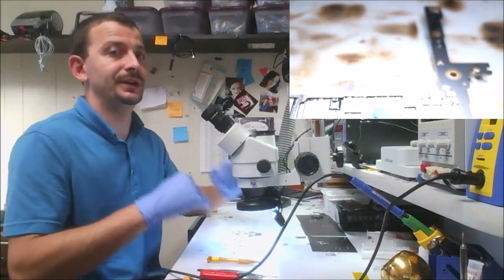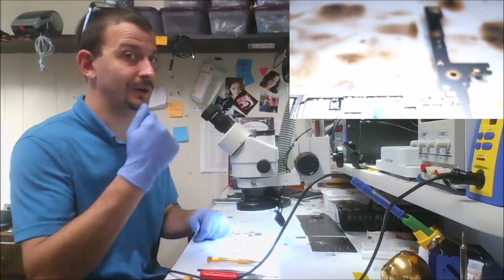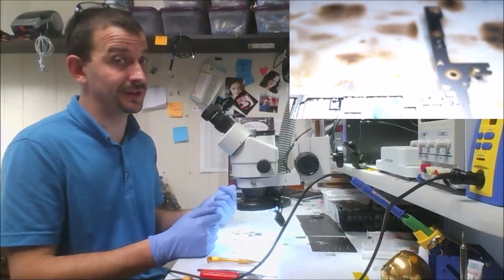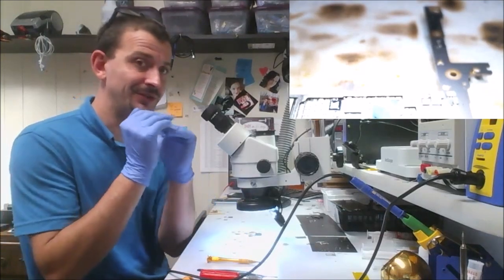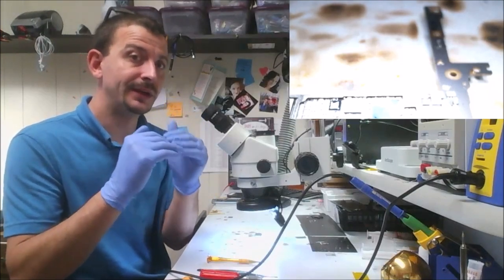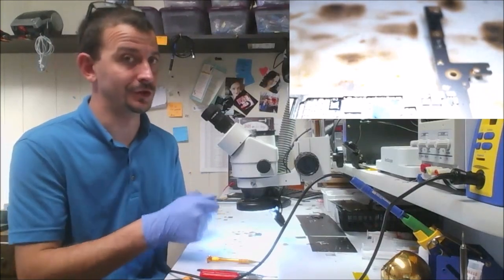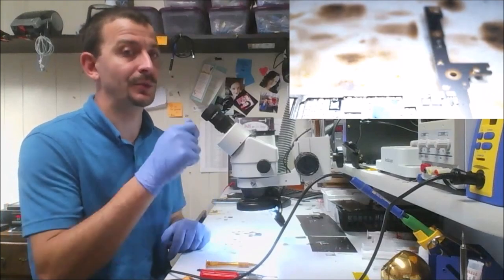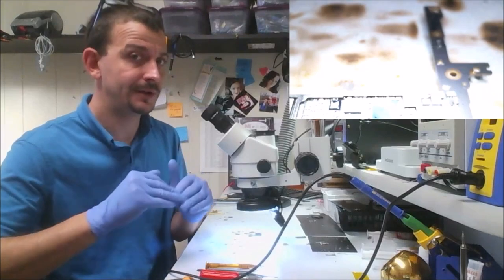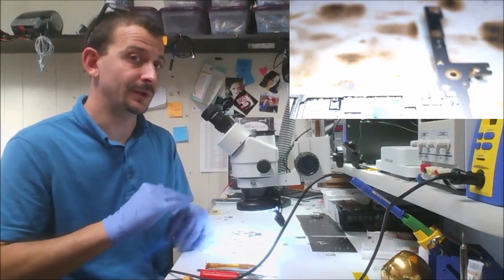But I believe that there is something else really, really weird about the iPhone 6 Plus board and the way this problem can resurface once in a while. Why doesn't it happen to the iPhone 6? It's the same components. It's really bizarre. It's almost like there's two layers of the board or something that are getting some sort of inductive coupling. There's something really weird going on with this defect. It's not as simple as, oh, change the chip. There's something happening during the replacement of these chips. There's something else at play here that has more to do with bending and the chip. But correcting the issue with bending is enough to get rid of it as well.